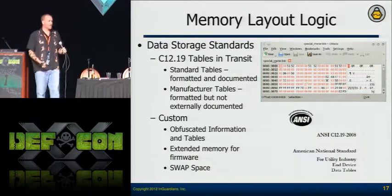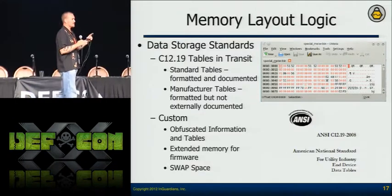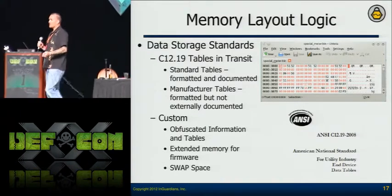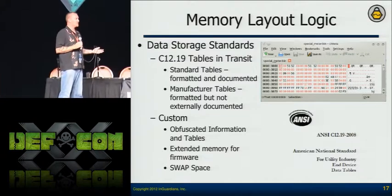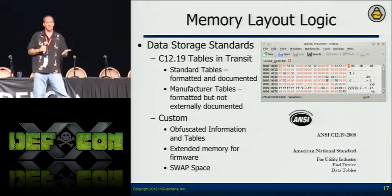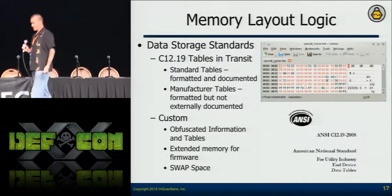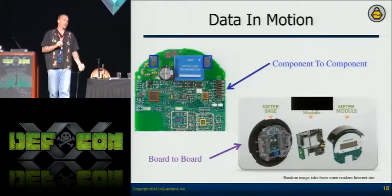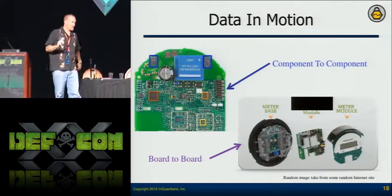Once we get the data, what is it? It's just like any other file system, but there's no pointer saying 'this is the data you're interested in.' You can run strings on it and get some interesting information. What I turn to is the ANSI C12 communication standards. The reason is that embedded devices want to be efficient — things are going off a radio, so they've got timing issues and not a lot of CPU power. Sometimes they just write straight to memory. So you can use these standards to help understand the data structure and locate certain things within that memory dump.